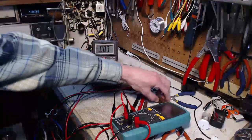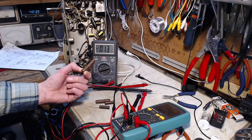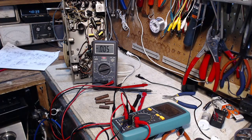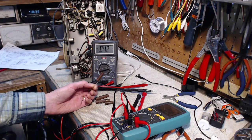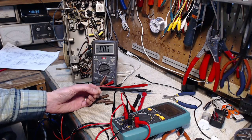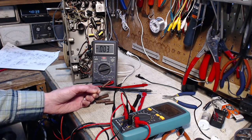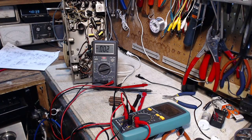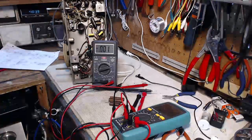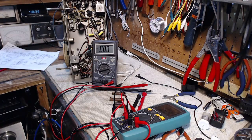Well, this is telling me that these little guys have turned into batteries. The reason they're batteries is they have moisture that's gotten inside them. There's nothing hermetically sealed about these anymore. And the moisture has gotten in there, and there's some kind of mixed metal situation going on in here. There's probably aluminum foil, and these are plated with tin, probably tin plated copper leads, something like that. And if you look at your electromotive force scale, you'll see that they are a little different. The copper, the tin, and the foil that's inside there, really, I can only guess it's aluminum foil, I really don't know. Aluminum is very electronegative.